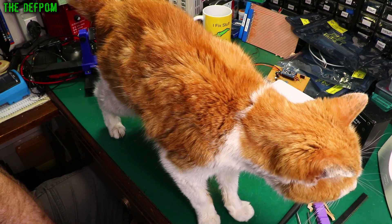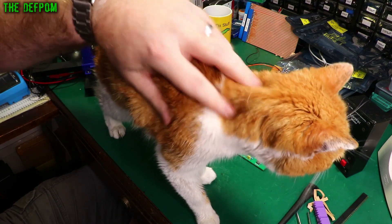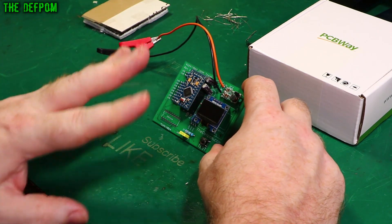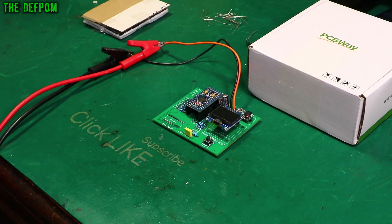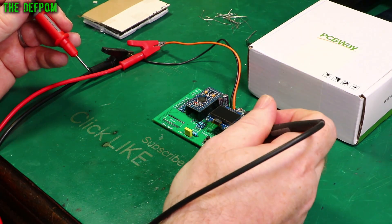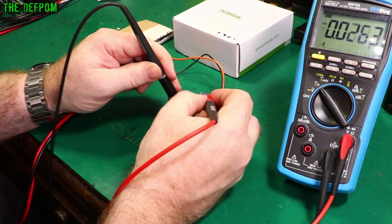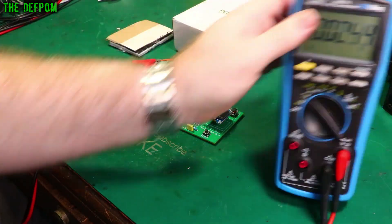There's a cat on the camera — she can see a big cat on the screen. She's getting stroked and can't quite understand it. Alright, don't forget to click like and subscribe. Let's try the board out — I've programmed it. The display did come up briefly whilst I was doing the programming, so something's working. Let's power it up for the first time properly with this supply. I'm confident the supply works okay, but I should actually verify that too — it might go bang. There's a ground right here; I'll tap onto that and probe onto the VCC pin. I want to see what the voltage is here. Measuring now — 5.05 volts, that's fine. Display's coming up — so far so good.